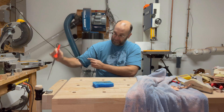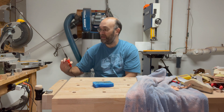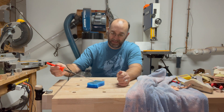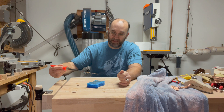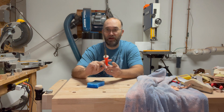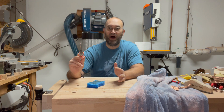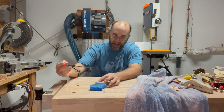It's in there good and tight — I put enough copper tape to really pin it in there and then used the grub screw. In terms of safety, this is as safe as having a hot metal stick could be. I'm going to touch the end to the sponge to see how hot it is — it's making considerable steam. The point of this tool is that you drill a hole in the fretboard and stick it inside the guitar joint so the joint heats up, melts the glue, and you can take the neck off. You don't want it so hot that it lights the wood on fire, but you can see it's pretty warm.